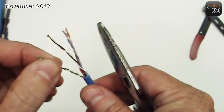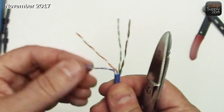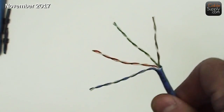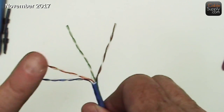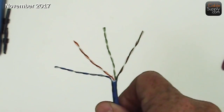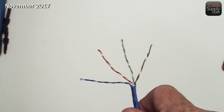Let's get it in the right color code — I always like putting it out right. You don't need a color code to punch down cables, at least not my cables, but I always put it in that way. It's always called twisted pair, or pairs of cable, never single wires. I see some people describe these as eight wires — it's four pairs. Same thing, but that's what the industry calls it — four pairs, that's the industry standard.